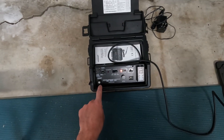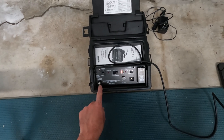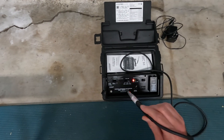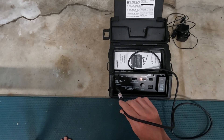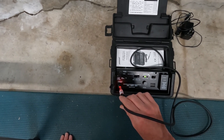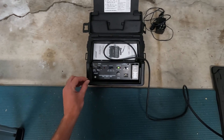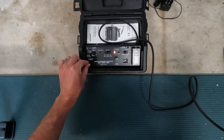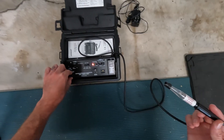They give you a little tiny vial of refrigerant here for the calibration reference. This is a small amount of refrigerant inside for calibration — it's where when you want to adjust it on manual, you can tell that it's picking up refrigerant. It's got a little tiny pinhole on it, so you know it's picking it up before you even start your leak test.